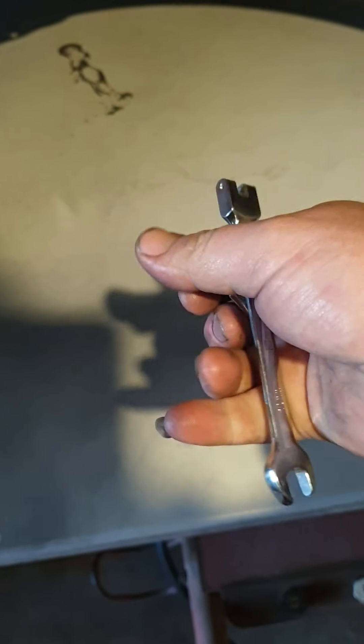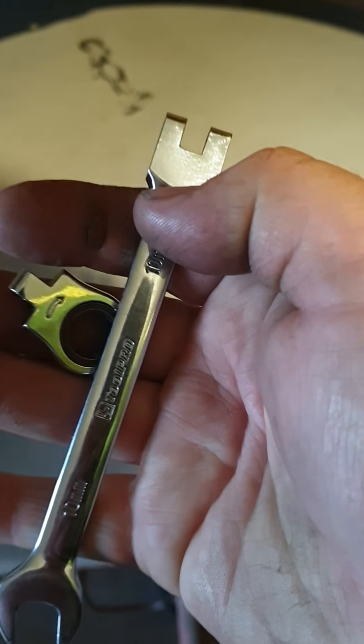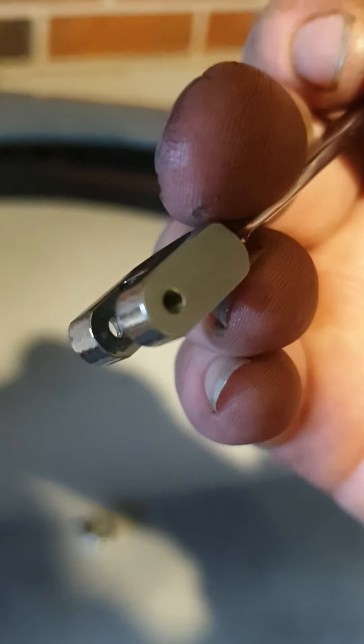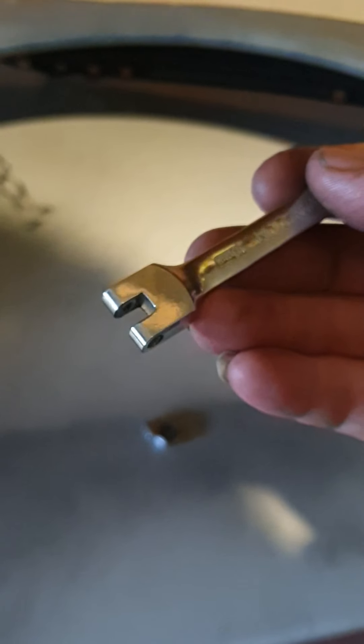Here is the Chrome Vanadium Tool Pro. I got this from Super Cheap Auto and they're pretty good. I actually don't have any complaints, but the pin just disappeared. They thread in. My only complaint — if you get a set of these, undo that little Allen key, take it out, put some blue Loctite — something you can undo at a later date — just to keep it secure.